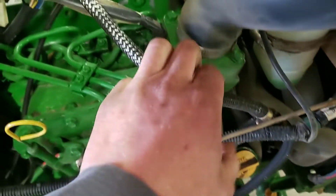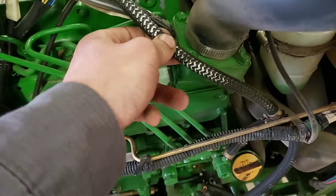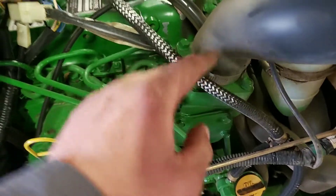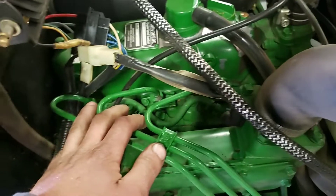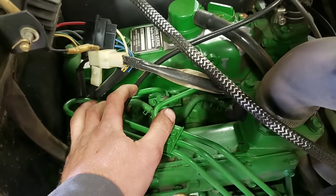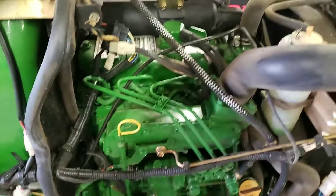So like I said, if you're having trouble priming or bleeding it out — just changed the filter or ran out of fuel — find your return line, partially crimp it off, allow a little bit of flow back. You don't want to build up too much back pressure, that'll cause other issues. Nine times out of ten it'll start within two to three revolutions, start real low power, then pick the RPM right up and you're done.